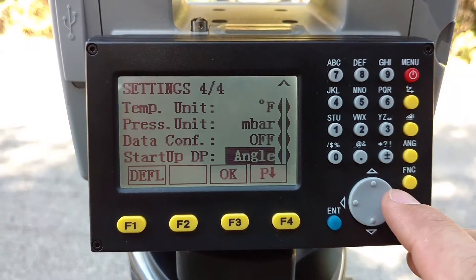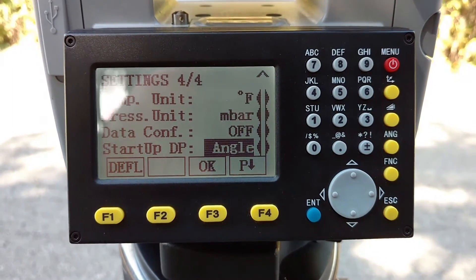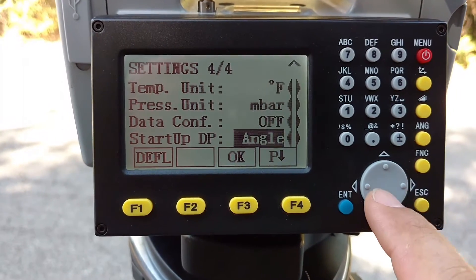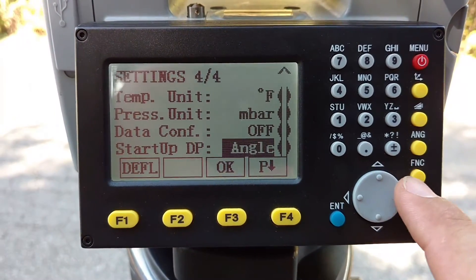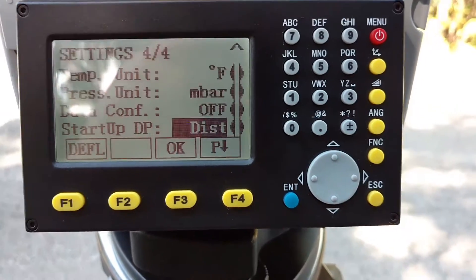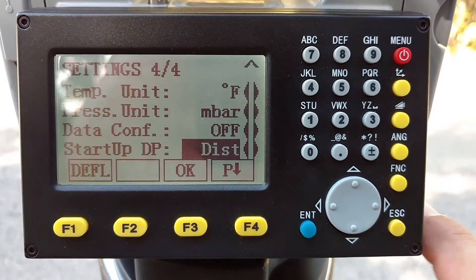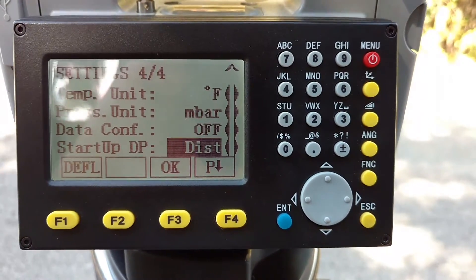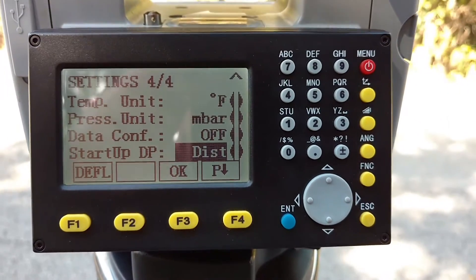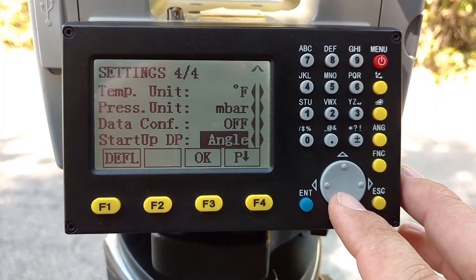Start up. In the stakeout and on quick survey, when you start up, you're going to look at angles instead of distance. On the stakeout menu, you're going to see the option on the left to view the angle immediately. If you change this, you can view the distance immediately. I like to turn my angles first — we'll talk about that in another video on staking out. Horizontal angle is generally what we're going to look at first, so I just leave it there.